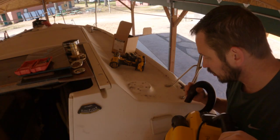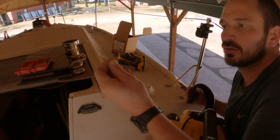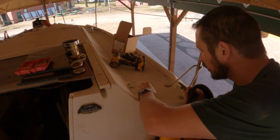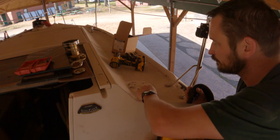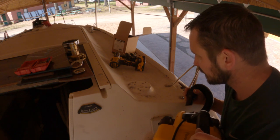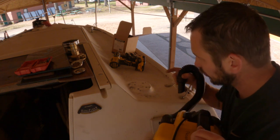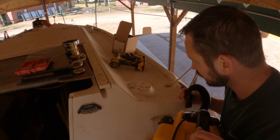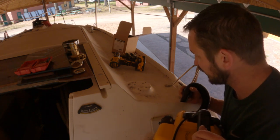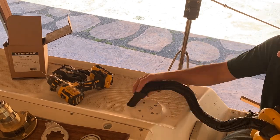I got the first holes drilled. I'm going to clean up my mess. There are a whole bunch of aluminum shavings because they buried an aluminum plate inside the fiberglass — and they had actually drilled and tapped into them. I want to put butyl tape around there to seal it and just have that bolt be able to slide down it. It's kind of nice to know there's a backing plate sandwiched in between all that fiberglass — that should certainly help it be stronger.